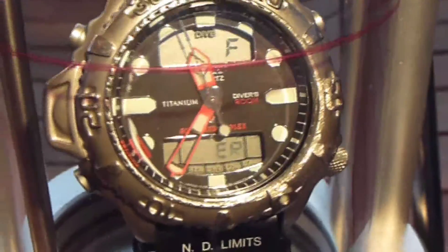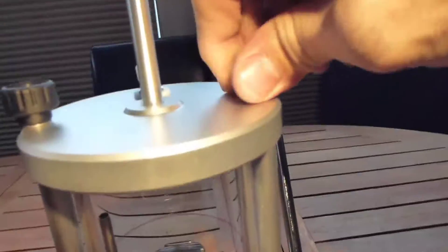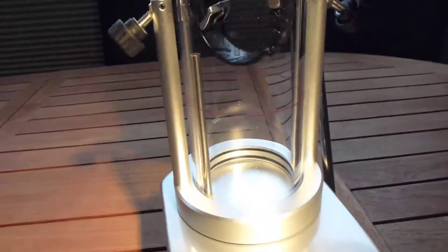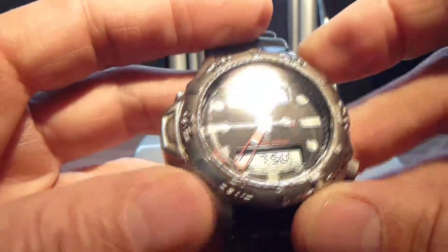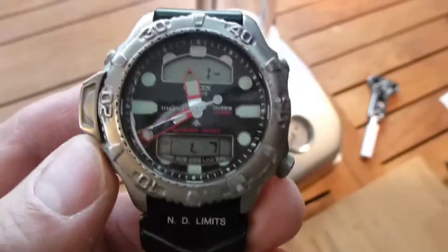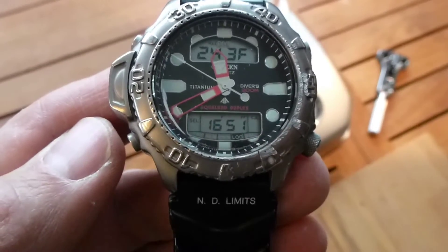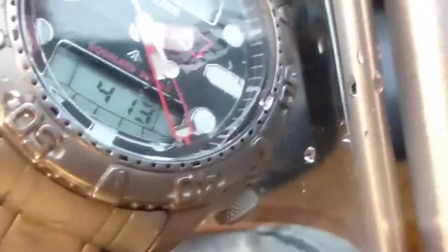This test confirms my suspicion that the six atmosphere testing units like this one are probably very similar to the ten atmosphere units, with the exception of the gauge range and of course the price. Let's pull the watch out and use the dive log to review the test. The dive log is showing max depth of 243 feet on top, and the duration was 16 minutes 51 seconds — about 17 minutes holding pressure. That's a good durability test for the machine.